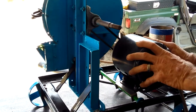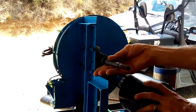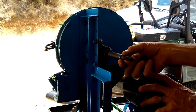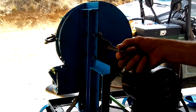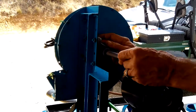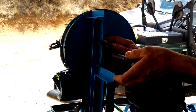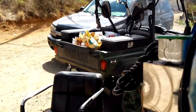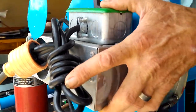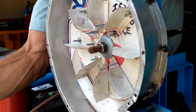We've modified this part of it. This is the original fan housing — the number 550 mandrel from Chicago Die Cast. Your shaft is 5/8-inch diameter, and you'll get a pulley, two locking collars, and two bearing blocks with it, as well as your nuts and washers. You've got one left-hand thread and one right-hand thread. Now if you come back around over here, we're going to take the cover off and show you the internals of this fan. Now the blades are here.